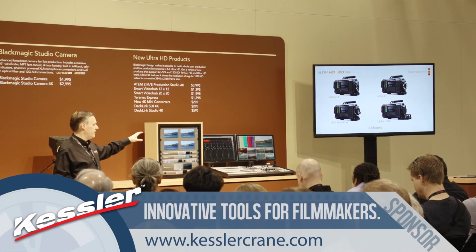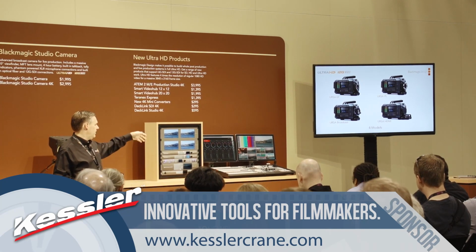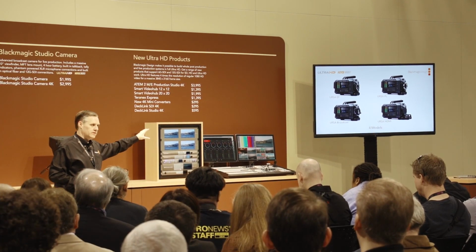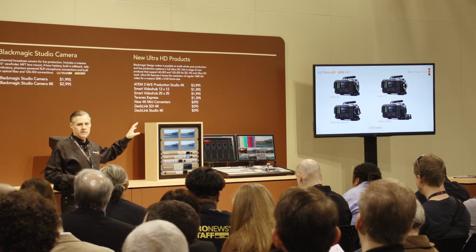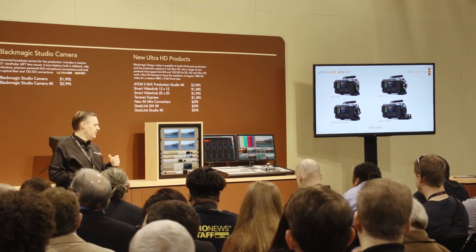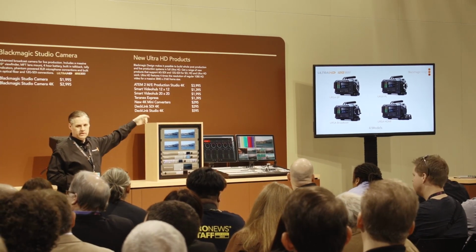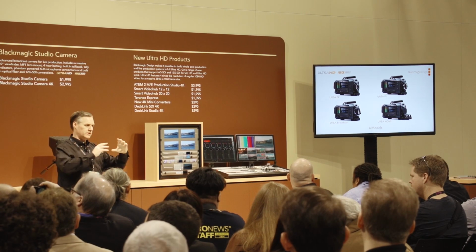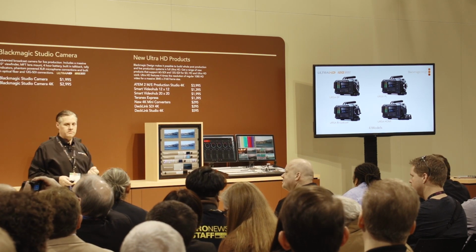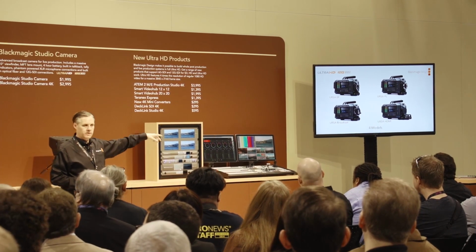But we really wanted to show that, because we had to design the camera with that in mind, but we also need to do a little bit more work on that. But that's a different sensor, so that really shows how dramatically customizable this camera is. That we can change out the sensor and the turret, and even some of the features like having a neutral density wheel in there. You can't do a neutral density wheel on the big cameras because they'd be quite physically large because it's such a large aperture. But broadcast mount lenses have got a tiny aperture on them. Also, there's a lens control port on that one as well, I've got it at the front.